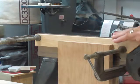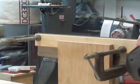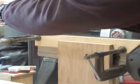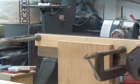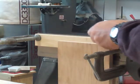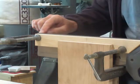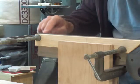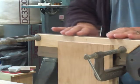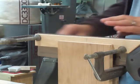And if I can't see shiny teeth, which means I haven't made them equal, some teeth were worn more than others, and I've not hit those yet, and I can see the black marker, then I'll take another pass. Like that. And if it's a big disparity, then keep going. I'll do one more pass. Like that. Now, I've got shiny teeth most of the way. I don't have them all. Don't be that worried about the perfection of it. But you're trying to knock some of those worst ones down and get the height of the teeth pretty close. That's the gist of it. That's what you're really after.